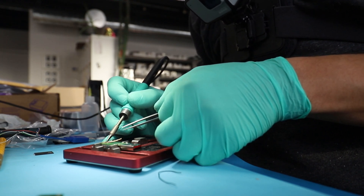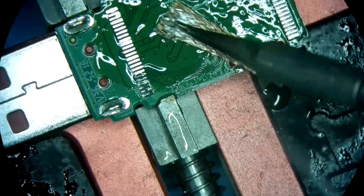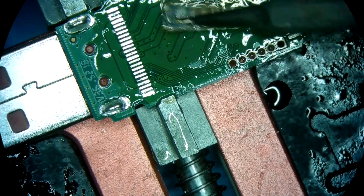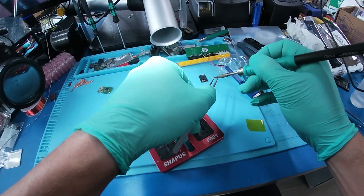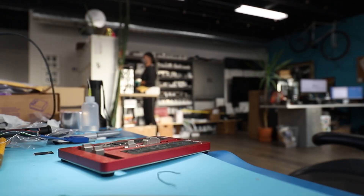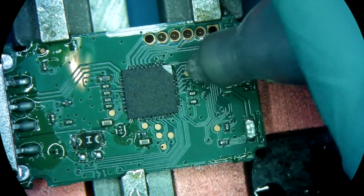Using the wick, I'm just going to take off all that extra solder that was on the pads — we're not going to need that anymore. To plug it in now we should at least see the controller come up. Not even a controller response, it's just blinking. Very uncertain about the situation with this controller.